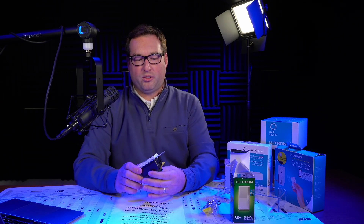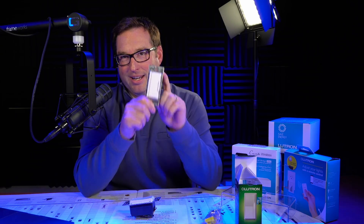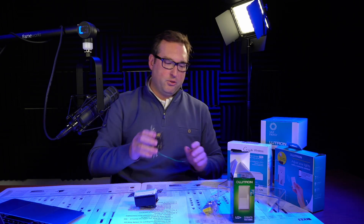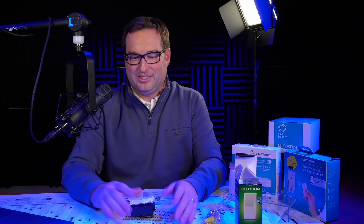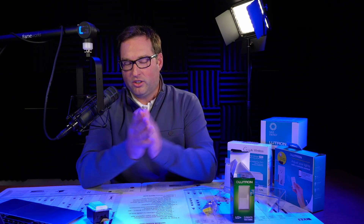What makes RA3 different than the good old tried-and-true benchmark RA2? Many things. One of them being the new processor. PoE injected — this is exciting because I don't need to have a power supply at the end when I'm putting a repeater down the line. I just plug into my PoE switch and we're good to go.